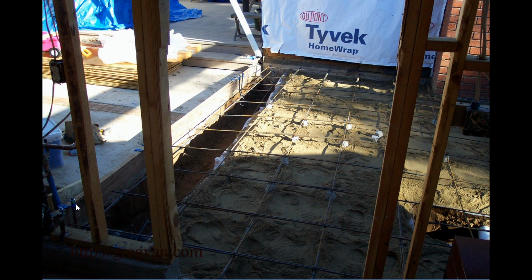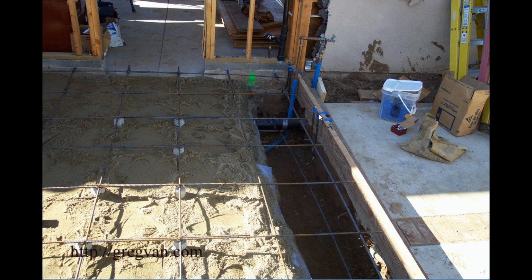And you can see right here, one of these is probably the hold down. I don't know if you can see it over here, but they're the right height. I mean, they're at the same height. Someone just made a mistake and thought they were anchor bolts and didn't need to go up any higher. And that's not the case. Here they are again. So I'd imagine we got an anchor bolt, and you can see the little S bolt here for the HD. So right height, if you do something like this, make sure you check everything.